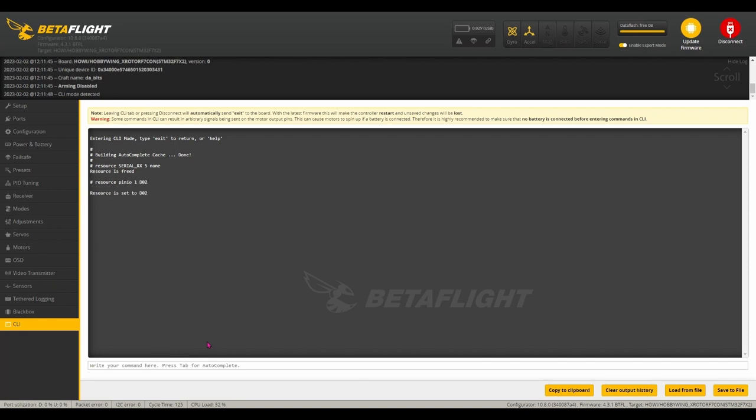The next thing that we have to type in to make this work is get our user one up. So we have to type in set pin_io_box = 40, 255, 255, 255. That 40 is basically for user one, and then that's also associated with pin IO one.